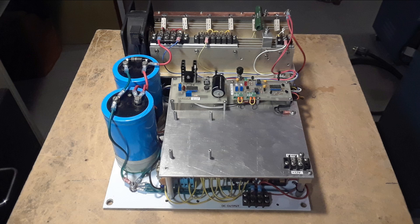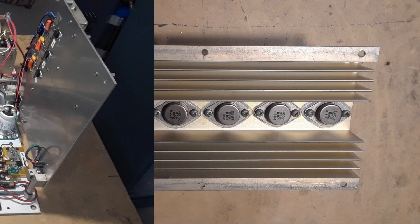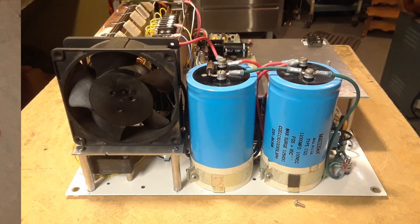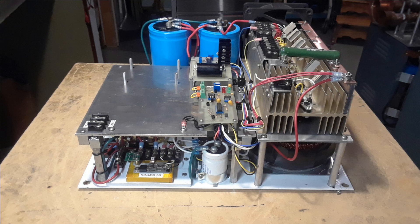So this is what it looks like. The two circuit boards are on top of that plate — the one on the left is the regulator circuit and the one on the right is the over-voltage protection board. You can see the two green terminal strips there with the jumpers selected. The aluminum plate is hinged and swivels up so you can get access to the bottom. The black terminal strip near the back is where I select the different taps for the secondary off the toroid transformer. The large heatsink at the back is where the six 2N3055 pass transistors are mounted. The heatsink is built as a module so it'll unplug via terminal strips and pull off if it needs to be worked on. You can see the fan from one side and the filter capacitors, and on the other side the large toroid tucked underneath where the heatsinks for the pass transistors are.